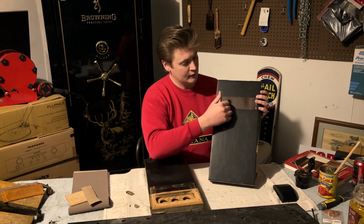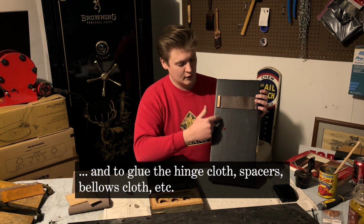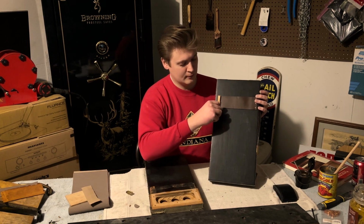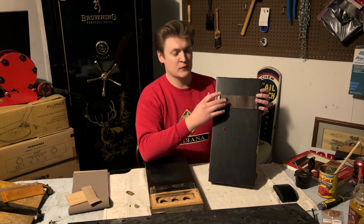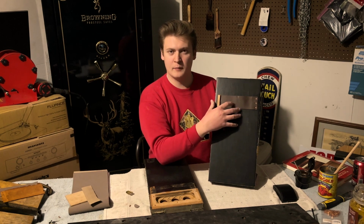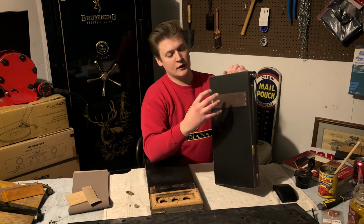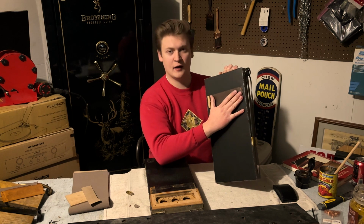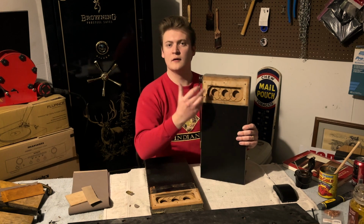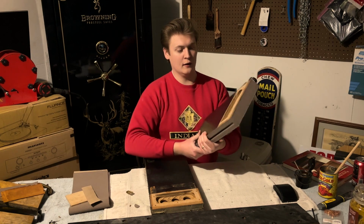on this edge of the flap valve. And this wooden block has a spring tension applied to it by this little spring, which is screwed in here, and there's a little staple here to act as sort of a fulcrum to give it a little bit more leverage on the wood. And all that serves to do is to keep this flap valve flush up against the back of the bellows, so that when the bellows is opened, it cannot draw any air through here, because this flap valve is suctioned to the back of the bellows, which causes it to draw air from here, which lowers the air pressure in the reservoir, again, to generate a source of vacuum.